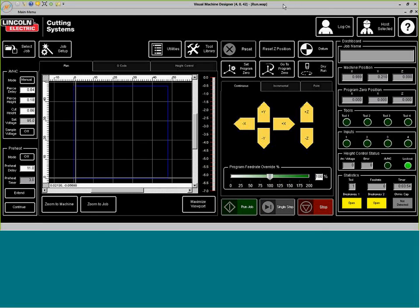that. We want to generate the offset to understand. So when we do bring in the file from the CAD, that the plate marker tool that you have located to the plasma can say that 4 inches is 4 inches. So we know that the plate marker is offset from the plasma, and the plasma in this case is always going to be tool number one, which means that it is going to be the master tool.